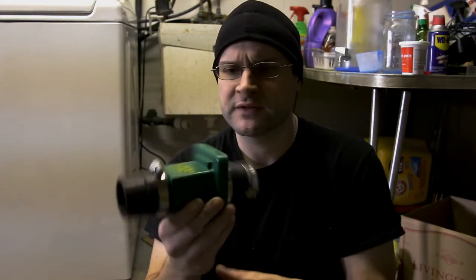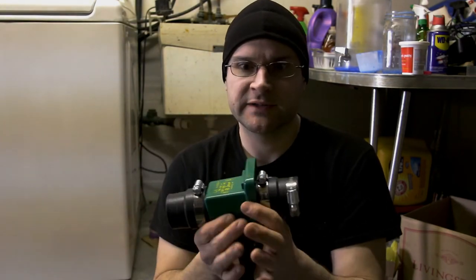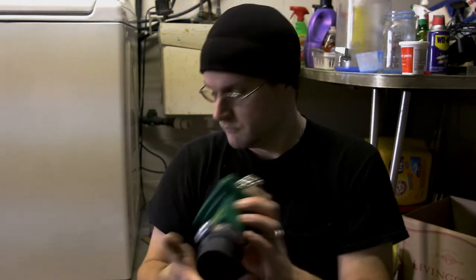Now the check valve is there to prevent water that's up in the pipe. This is your check valve. This is really to stop the water from back flowing into your pump and up into your sink, and it kind of stops sewer gases too. The water is going to flow one way. Usually it's marked, so you want to be mindful of that so you don't put it in backwards. Make sure you install the check valve the correct way. Usually the flapper flaps like this and where it closes, that's where the pressure is going to go to close the check valve.